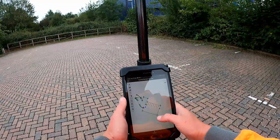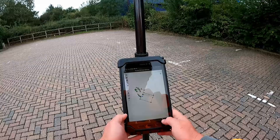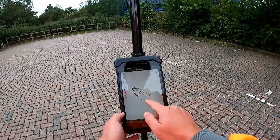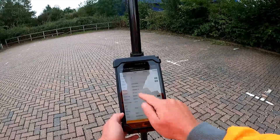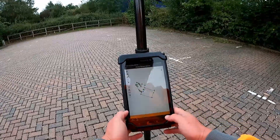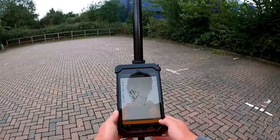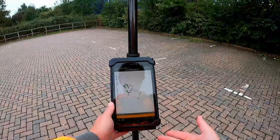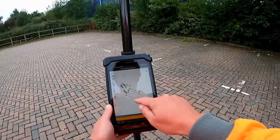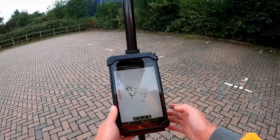You can also work out distances and areas. Going to the measure feature, we've got distance and area options. To measure distance: first position is point 27, second position is point 28, and it's already telling me it's 21.5 metres long — that's this line along here. Really straightforward and really quick. You could add multiple points together diagonally or capture additional points very quickly.